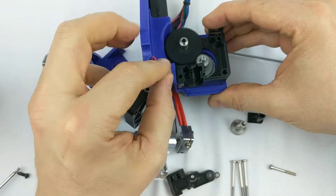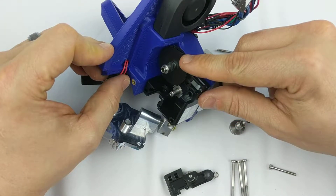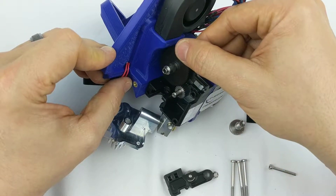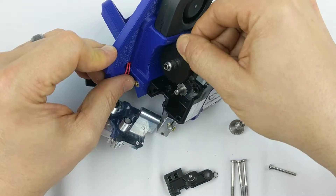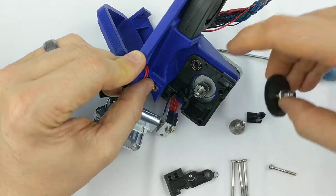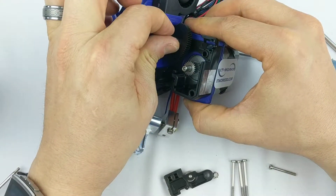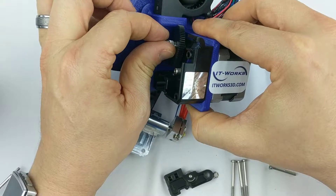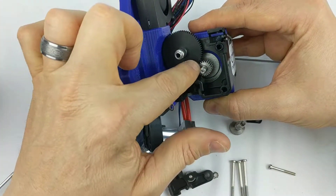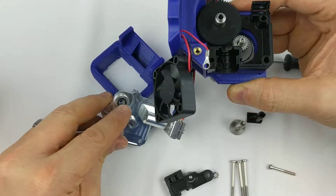If you're going to replace your hob bolt because it's worn — this one's a standard hob bolt. You can tell a standard one because it's silver; the ones with the black shaft are hardened. We sell hardened E3D hob bolts that let you print abrasives without wearing out your hob. This just lifts out. Make sure that your bearings are in good shape while you're in here. To replace this, I'll usually place it at an angle into the bearing, then sort of snap it flat, making sure these surfaces are nice and flush. Also inspect your bearing that's in the heat sink.